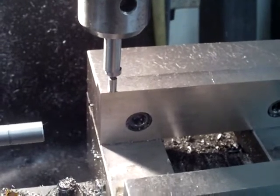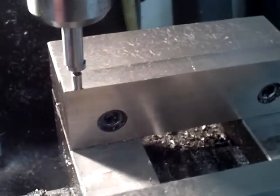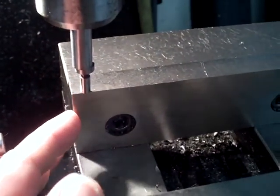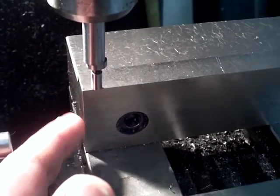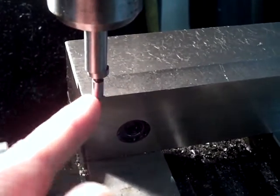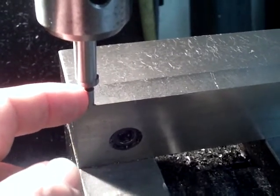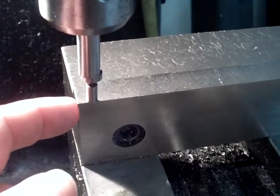We've got the wiggler back in the spindle. What we're going to do is go off the edge of the vise. I want to set everything to the edge of the vise so I know where this corner is. Zero, zero on the part is going to be the corner of this vise. Since this vise is old, it has a small lip on it — I can feel it with my finger, maybe a thousandths or two. So we need to take the y-axis and move the spindle in, so the center of this 200-thousandths wiggler is off of that small lip.